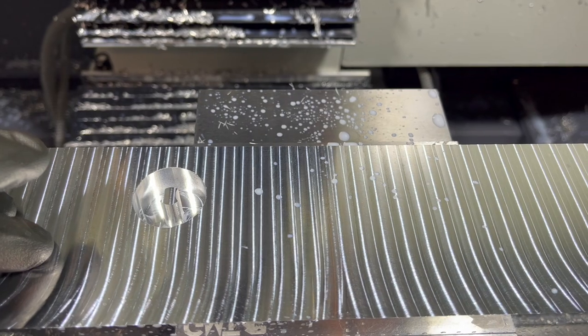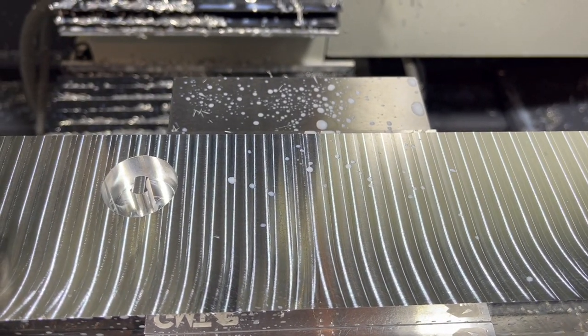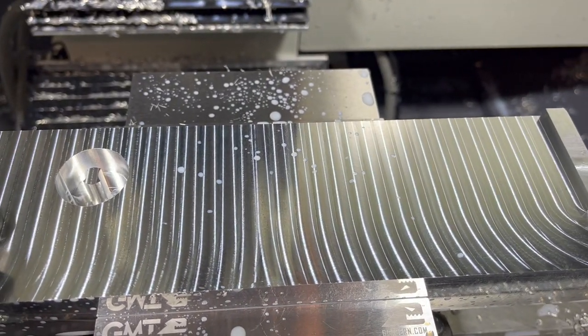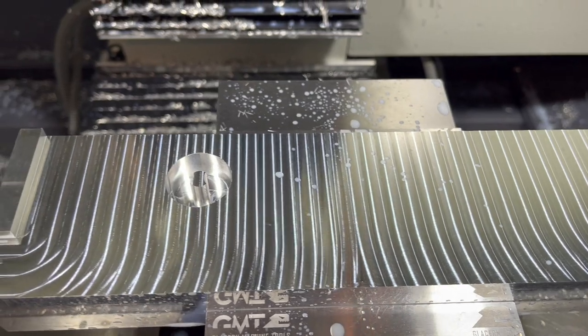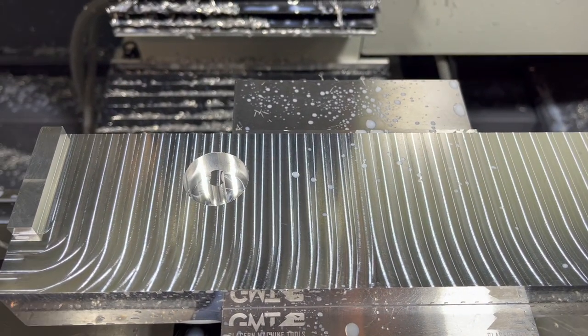I'm gonna go ahead, do the tool change, and I'm gonna drill the other holes, and I'm gonna go ahead and drill that tap drill size through here. That's what's already set up. That'll get rid of the middle piece, and then I'll counterbore around and do that, and then I'll be able to machine the next hole that goes all the way through. I'll be able to bore that from the start of the hole instead of having to bore it from the top. So I'll save some time there. I'll make up definitely more than what it's going to take for the extra tool change.